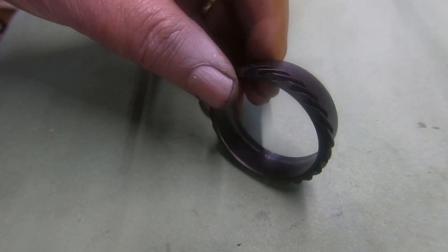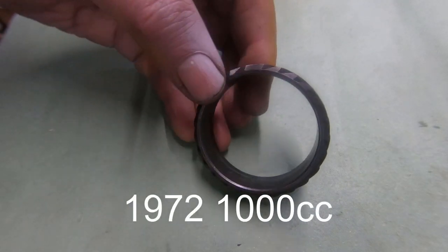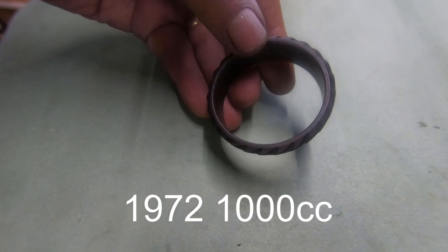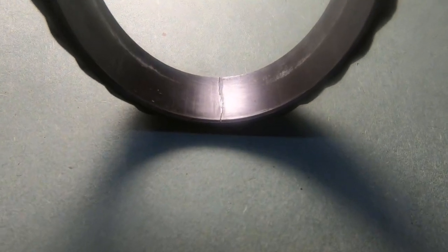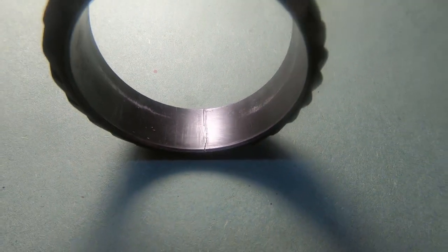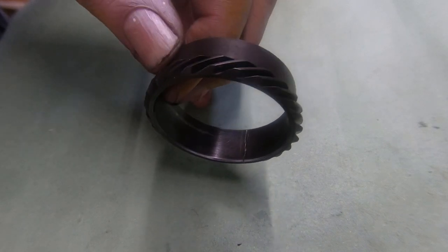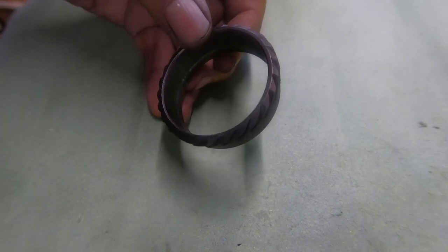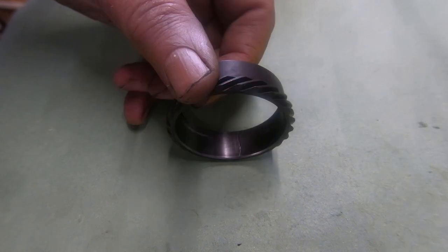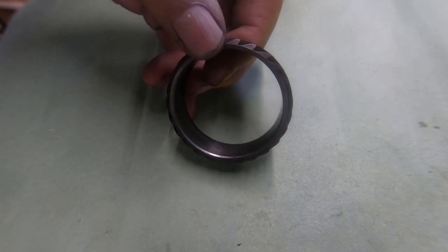What we have here is a gear off the speedometer drive on a Laverda vintage motorbike. Unfortunately when the owner tried to press it onto the wheel it actually cracked — you can just see it in the bore. I've been asked if I could do a repair. The only thing I could really do is silver solder the crack to create a strong joint and then bore it out to fit the wheel. The owner has decided he would like to use Loctite, so we just need to bore this out to a slight clearance on the wheel.